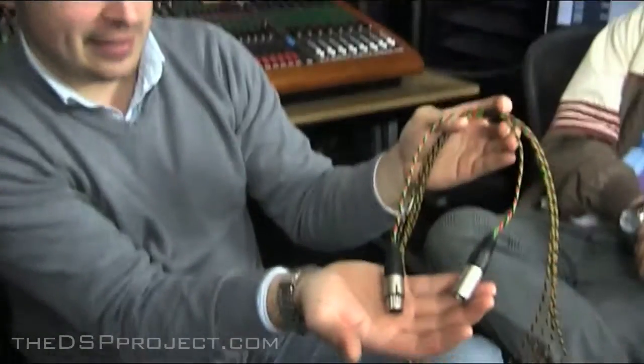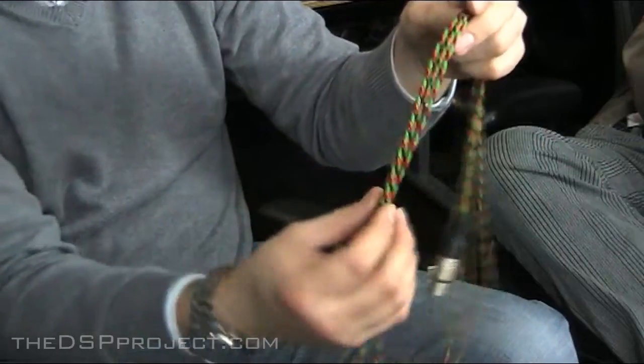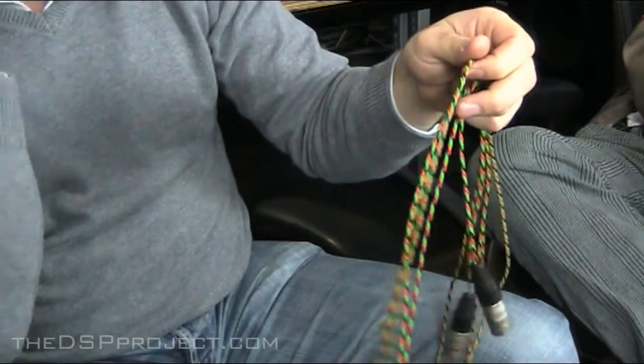Starting at the bottom going up, we've got Baby Junior — a cable that John made up, essentially. It's called Baby Junior now — that's the brand. It had to be very cheap and basic. Some of the equipment we build uses equipment wire, which is extremely cheap multi-stranded cable. Not even oxygen-free copper — it's just standard stranded copper. Very cheap — you buy it in a roll of 100 metres for maybe four quid.